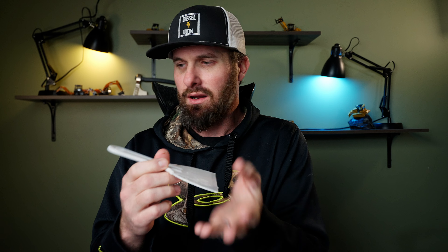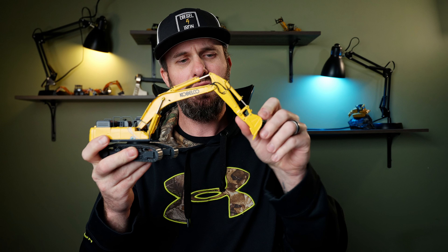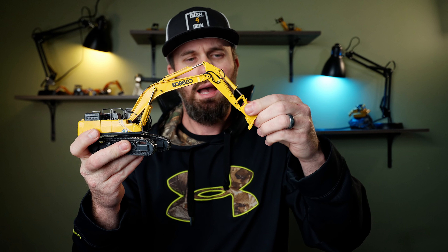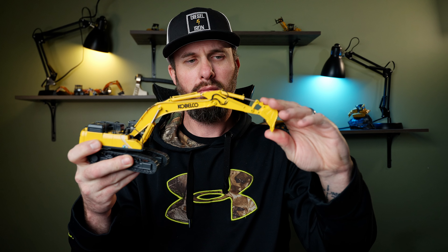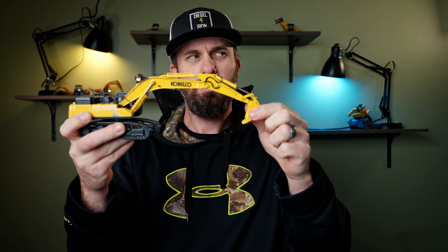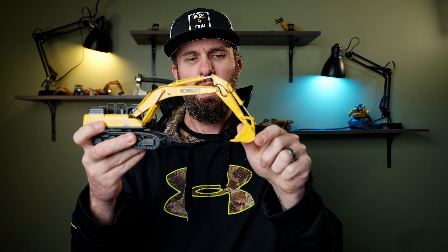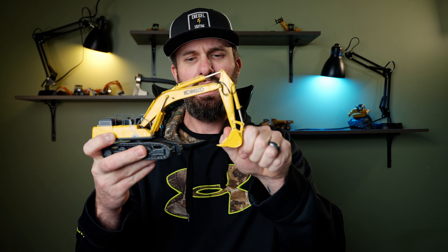That's exactly what we're trying to do in really hard material - all the concepts are connected. So if I'm digging in really hard material, I'm going to reach out a little further and bring my bucket to a shallow angle when I engage. Notice how shallow that angle is. As I start to stick in and curl, I keep that angle nice and shallow, so I'm not getting caught up in all that clay with all that friction. I'm able to just slide underneath it - that's a great way for dealing with really hard material.